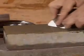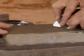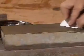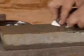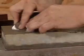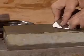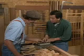And you can see how it's building a little paste. I see it. Yeah, there's a little darkness coming. This is the steel particle in the stone. That's the steel particulate. Even with a stone this fine, it's cutting really nicely. Wow. What a special stone. And I see how you're very carefully working over it with those short strokes. Right, working over the whole surface of the stone and trying to keep the stone flat. Because you can see it almost sticks. It's so flat, it almost sticks to the... Good heavens. The vacuum. Yeah.